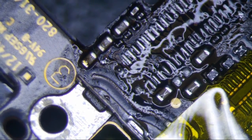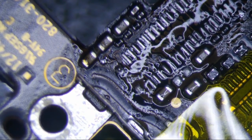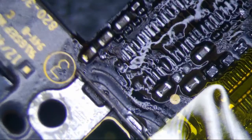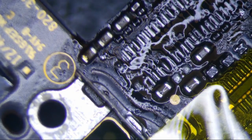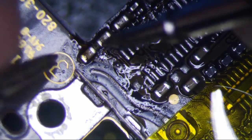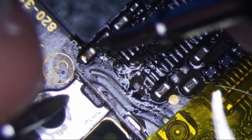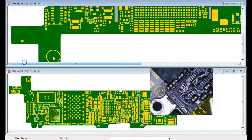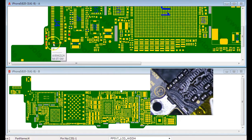Double check that joint right there. I'll just check it right now. Just want to make sure there's no continuity here, it's not bridged. It could be bridged. I gotta check the schematics. Alright, ZXW — just want to make sure there's continuity between these two pins. Okay, they are. So, no big deal. Everything is good to go.